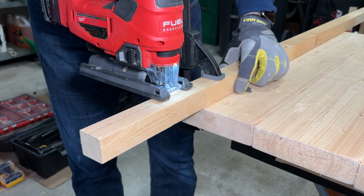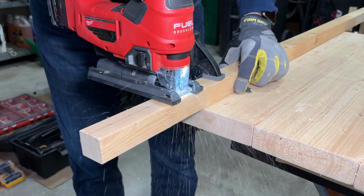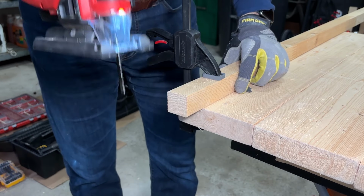The third method is to create your own cable holders that attach to the joist. I suggest you use a piece of 2x2. I cut a 6-inch piece of 2x2 so it fits inside the joist cavity.